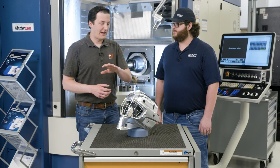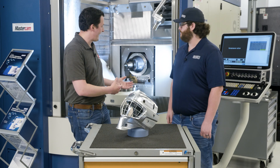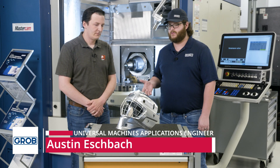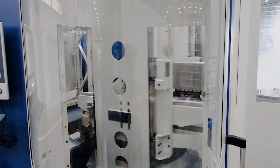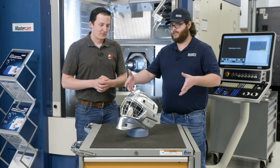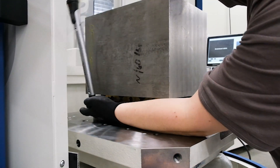These machines are absolutely fascinating. Their layout is very unique, as you can see here — they're a horizontal-style, five-axis machine, unique to the universal applications. This was cut on an HSK63 16,000 RPM spindle on a G550 machine. It also had a pallet storage system, the PSSR, to shuttle from a setup station to the machine itself. You can index the pallet every 90 degrees to access each point if you need to, and then with the click of a torque wrench, we were able to secure it quickly and transport it into the machine.